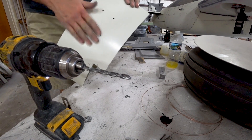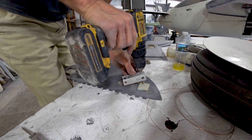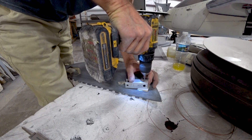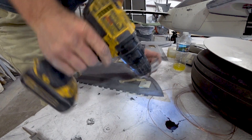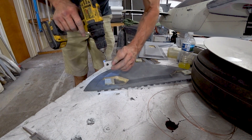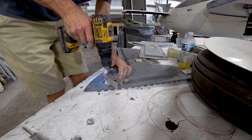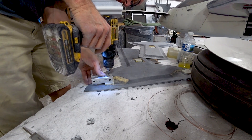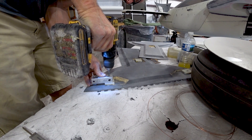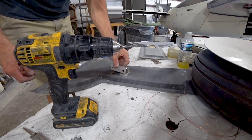The next thing is to fill the rest of that with some flox and resin mix and then do the layups over the top. I'm doing the same thing on the larger door parts and drilling these through — these didn't get any resin yet, just the five-minute holding them in place. The trick before we do the layups is to fill the holes with some clay so the hole doesn't get filled up with resin. Then once the layup is done we come from the outer side of the skin and re-drill the hole back through the newly laid-up carbon fiber.